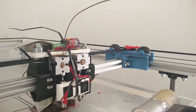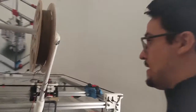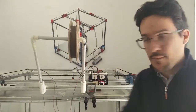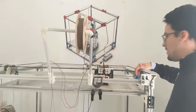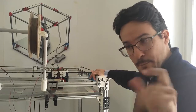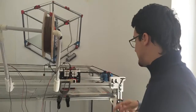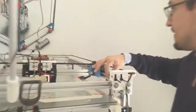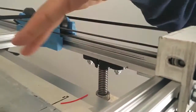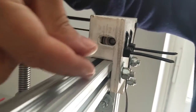We discovered new problems with the prototype. For example, when you use easy-to-insert bearings and steel pins, the pins can move inside the bearings when they rotate. That's what happened here — the white belt was pulled off by its own bearing because, by rotating, the steel pin came out. Let me check — it's still inside now, same bearings, but it's still inside.